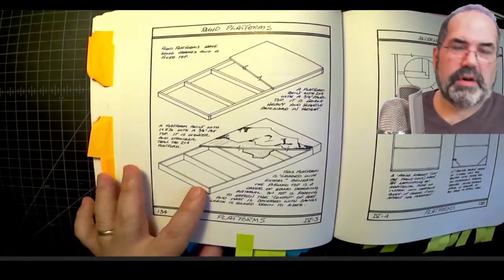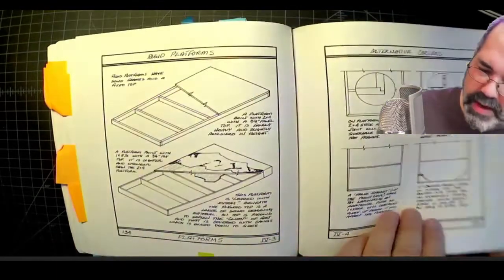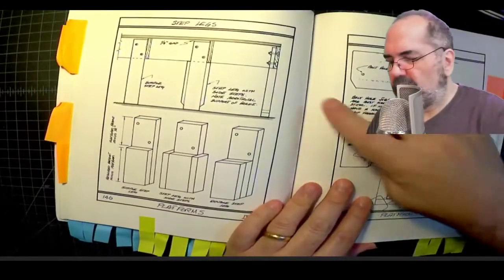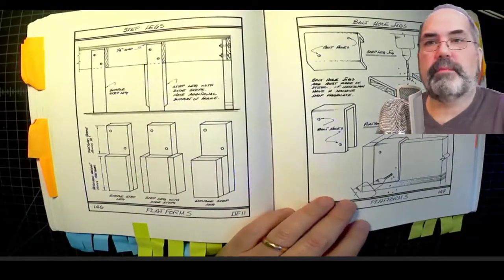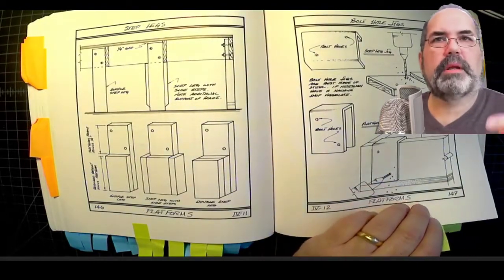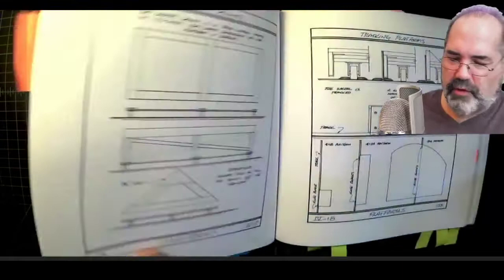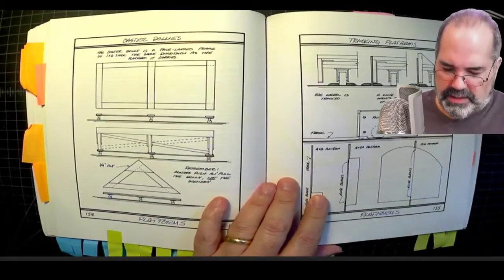Here they're talking about platforms, so we're now getting into platforms. We've got joining techniques, how to lay them out for curves, how to deal with legs, different kinds of legs, step legs and such. You always want to support the frame of the platform from the bottom — you don't want to just trust bolts. There's also a whole platforming section on hstech.org with a link below. We also talk a bit about caster dollies and how to set up guides on the floor.